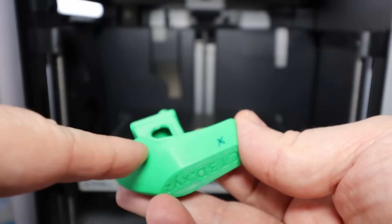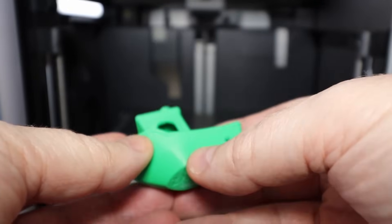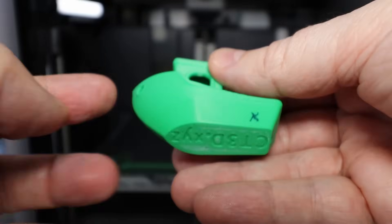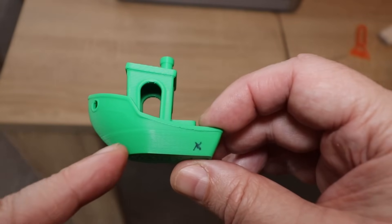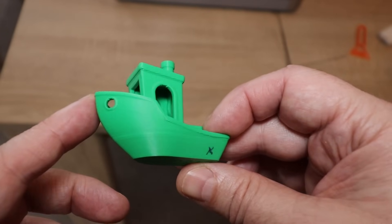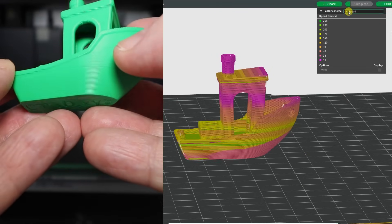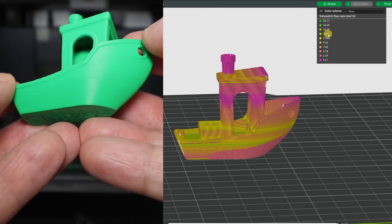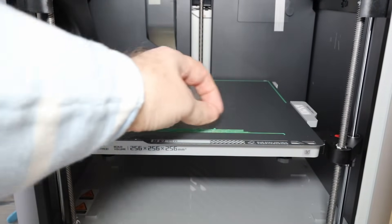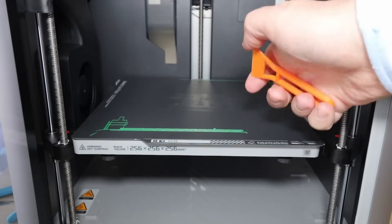Too many purge lines to clean so I have to print the scraper as soon as possible. I marked it because later I will compare it with the P1P Benchy. The quality is quite good — I can see some marks from the bed surface but no stringing, great overhangs, great part cooling. The only thing I don't like on this Benchy is this difference in surface sheen — here it is more shiny and here it is quite matte. I believe this is because of the difference in speed: when printed faster the filament is not melted as well, and this can be seen in the slicer too.